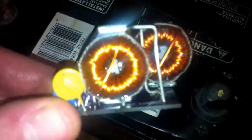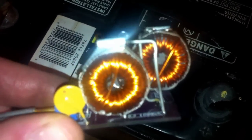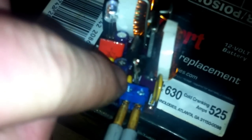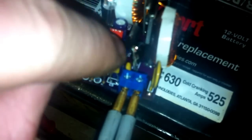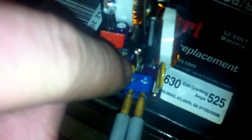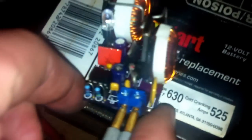Already built mine and it seems to be working. I used thick gauge wires on these coils so they're nice and sturdy — they're not moving on the board. I also raised this diode up high so that way you can measure voltage on that capacitor. You just take your negative and cathode on this diode and that's how you measure voltage on that capacitor. It's a lot safer than just sticking your probes underneath the board.